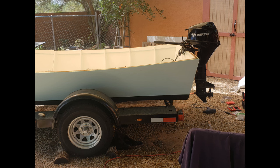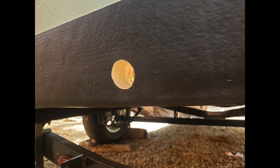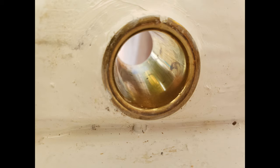I was eager to get the motor mounted. I had originally cut the transom per the plans, but true to Murphy's law, I had to build back up a portion of the transom with wood, screws, and fiberglass to have the 20-inch long shaft outboard sit at the right height. Drilling holes through a boat's hull is a nerve-wracking thing. I drilled a 1-inch hole for a drain plug on the lowest portion of the transom. It was one and done for that drill bit, but in the end I inserted a brass insert and things looked good.